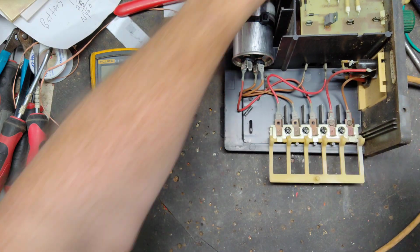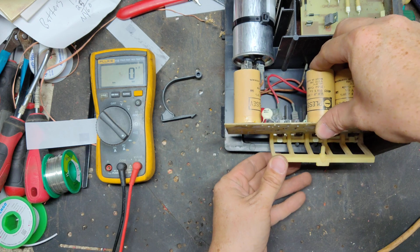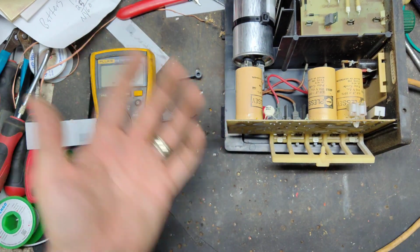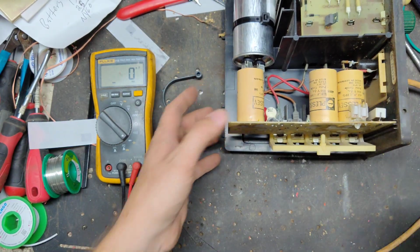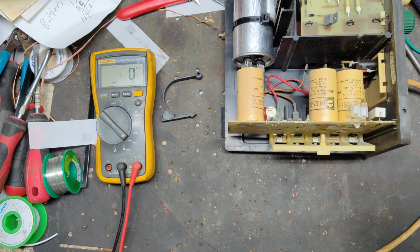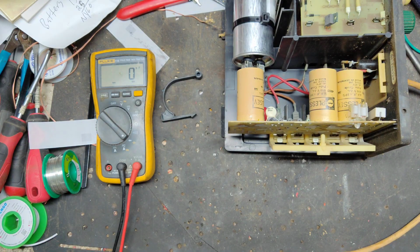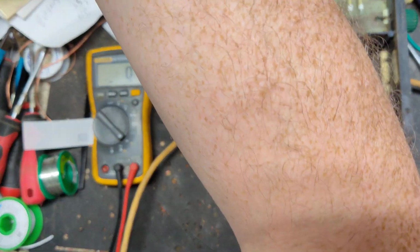We'll go ahead and plug this back on to see if it slows it down, which it's going to. It will slow the pulse down, which is a good sign, because you want to be able to build that charge up to a higher level across the capacitor, so when it discharges, it gets as much energy into the transformer as you can, so you have the biggest output that you can get. So plug it in again. This cord is pretty janky. You need to definitely replace it.